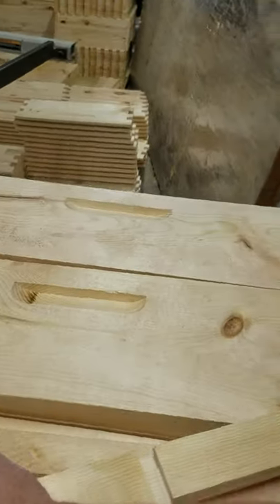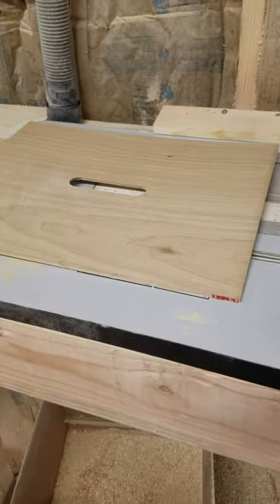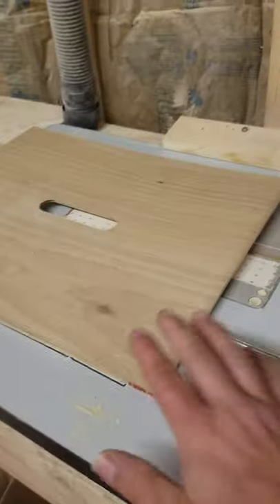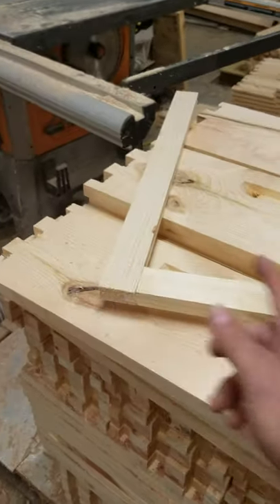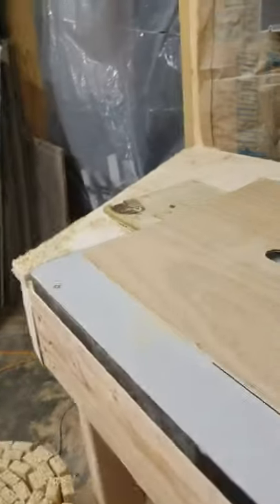I have piles of quarter inch plywood that I've cut down so that instead of being 19 and seven eighths inches, it's 17 and seven eighths inches long. The width of it is 14 and a quarter inches wide because our framework for the beehive is going to take up an inch on each side, and vice versa for the ends. So you've got to take two inches off the standard dimensions. Your piece is really an inch and a half wide on each of the two boards, but don't forget you've got the recessed space of a half inch on both sides, so we just take two inches off each measurement.